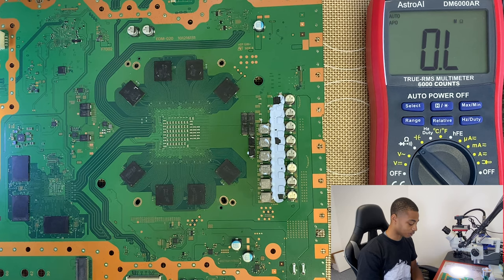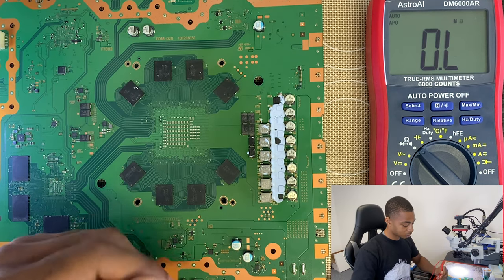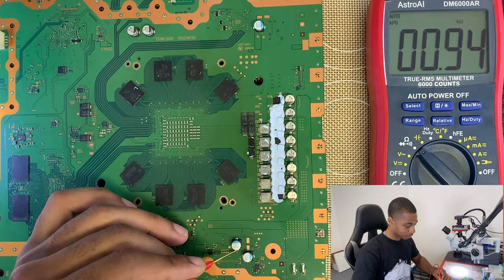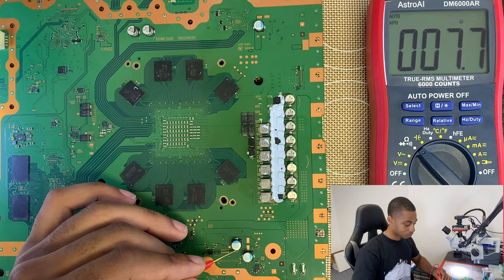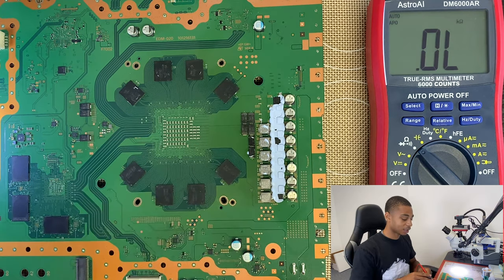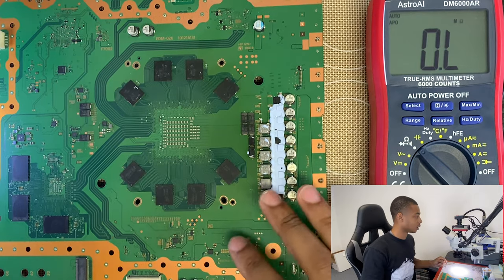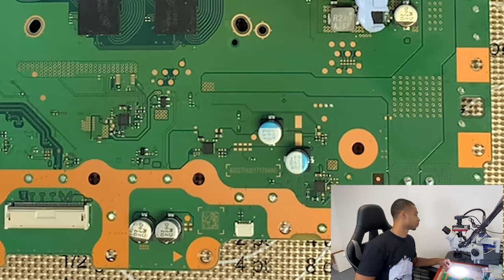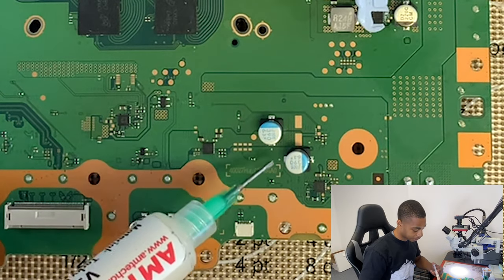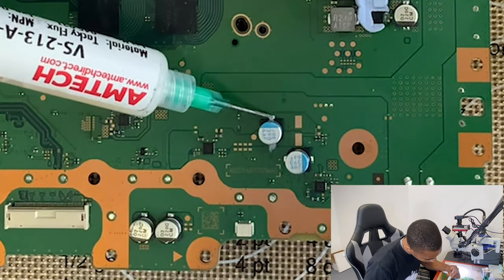That way our PS5 can work as it's supposed to. This component is also in that circuit — I'm going to take it off and inject power there, so I just want to show you guys it's connected. My multimeter is faulty, but that's less than six ohms. This side is a ground, so that's definitely less than an ohm. What we want to do is take this one off. Because we want the removal process of this capacitor to be as easy as possible, we're going to add flux and low-melt solder onto the pins, then apply heat so we can pull it off.